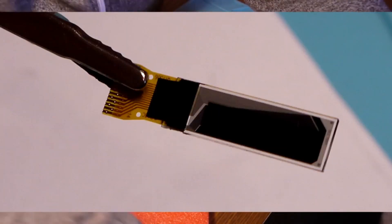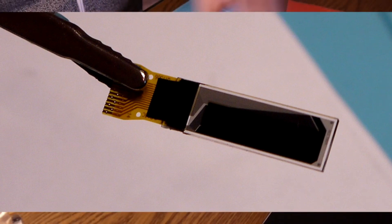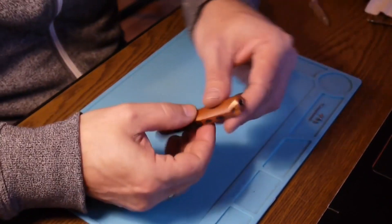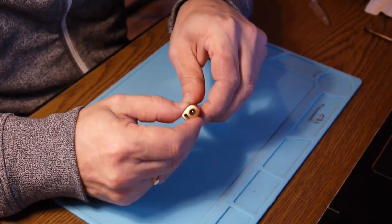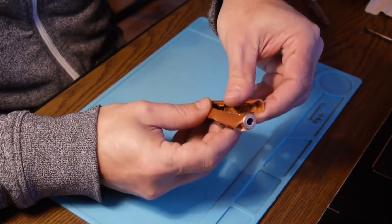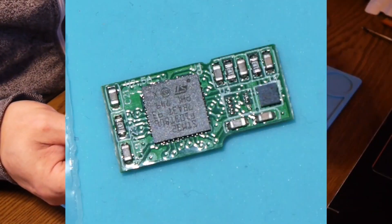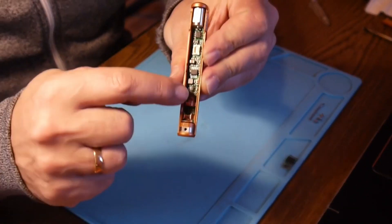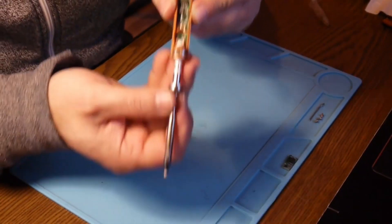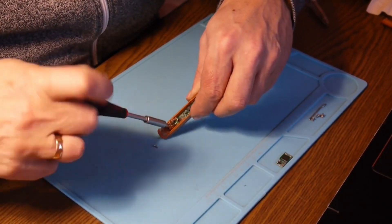This is the display straight from the factory — I bought it from Buy Display. The link is not good anymore but there's a new link in the description. I open up the TS100 soldering iron; it's very easy to do that — a couple of screws. Get the tips off, and there's the board. We have another two small screws keeping the tip in place that need to be replaced too.